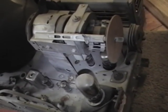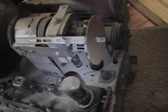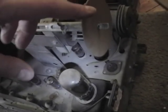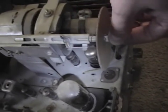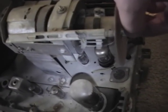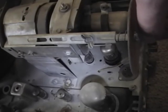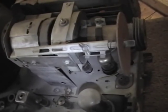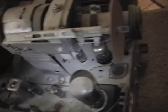I've tipped the chassis back down to talk about two last things. First is this gizmo — accessible from the back via this cutout — which is used for centering the picture. You grab hold of it and move it this way to center the picture vertically by rocking the focus coil, and move it this way to center horizontally. This is a nice feature Admiral came up with around 1950. On my older Admiral sets you had to reach into the set, loosen a wing nut, and manually directly manipulate the coil, which is not the safest thing to be doing.